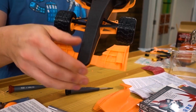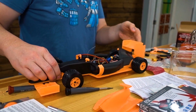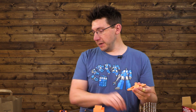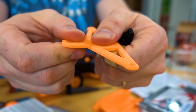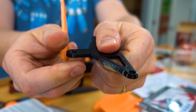and look right here. See that top part? That top part, that is black. And the reason it's black is because I reprinted it in PLA material. I'm out of Nylon X. So I went with PLA, and I went with 50% infill with a bunch of perimeters. So if you look right here, this is the part that was there before. Nylon G is a little bit flexible. PLA, 50% infill, is not.